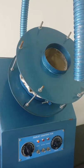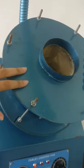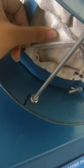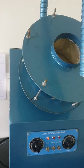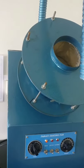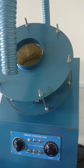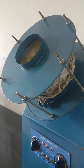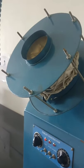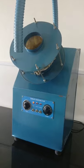Finished coated tablets are sent to polishing. This polishing pan is made up of canvas cloth. The polishing pan rotates at a suitable speed so that the wax coated tablets are rubbed on the canvas cloth. This is a proper shining method. Sugar coating is an art — only a skilled operator can judge the correct addition of syrup and dusting powder to give a uniform coating to the tablet.